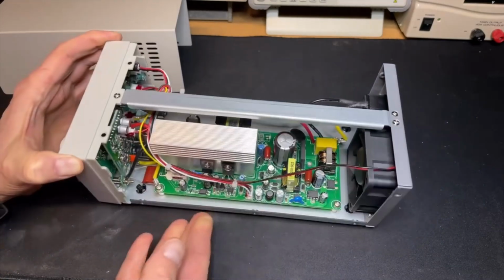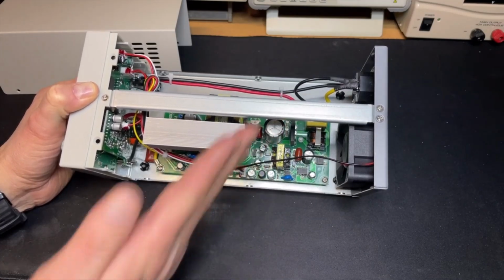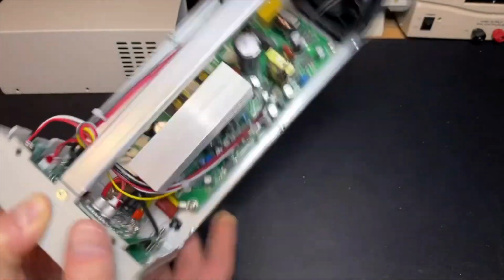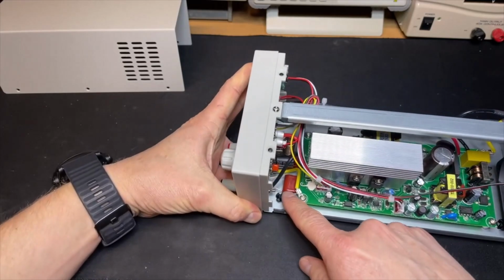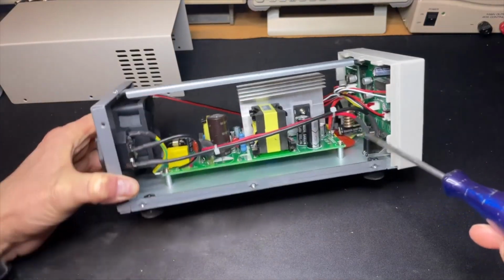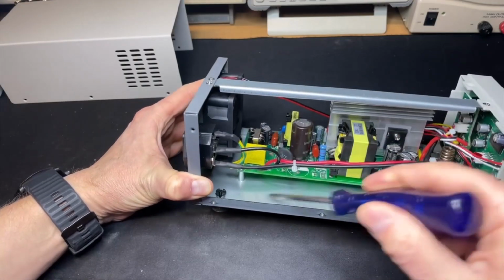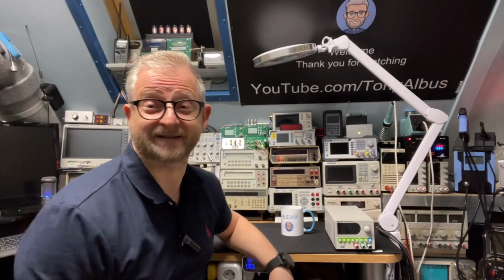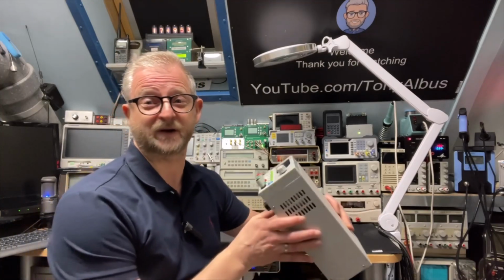Yeah, it looks quite simple. Sometimes you see some cutouts in the PCB where the isolation is. You can't really see that. So they didn't do that, the cutouts. There are caps here, I think to get the switching noise down. A real switch, not a soft switch. And you can see here that the grounding is also properly done on the screw on the whole frame. So they thought of most of it. So also on the inside, it didn't look bad at all, because it's entry level, and I think you get a lot of your money's worth.